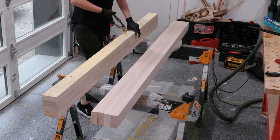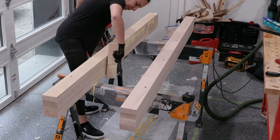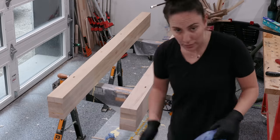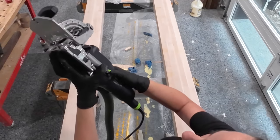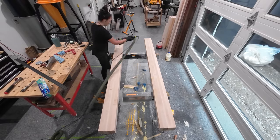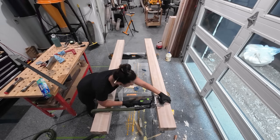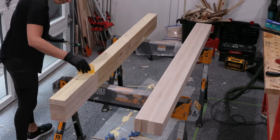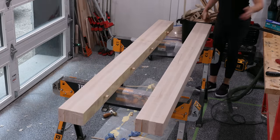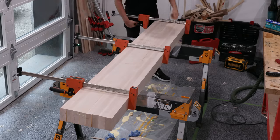Even with high-end tools like the domino you can make a mistake. I forgot to change the cutting depth and the mortises were too shallow, so I wiped off all the glue, changed the setting on the domino, and recut the mortises. But as I was editing this, I was laughing at myself — what a waste of glue. I could have just trimmed up a few dominoes at the bandsaw to fit the existing shallower mortises. We all make stupid decisions every once in a while; only difference is mine are caught on camera.